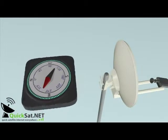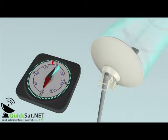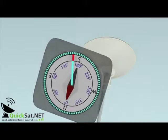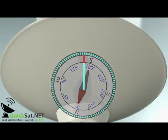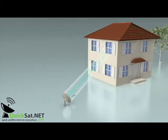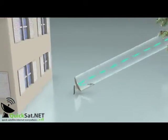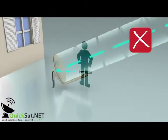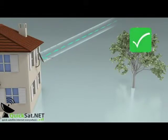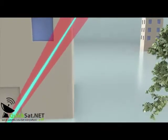Now you have all your parameters for your line of sight, you can start choosing your installation position. With your compass, identify the azimuth angle the antenna must face. You must have a clear line of sight to the satellite position with no obstacles such as buildings or trees. A person should be prevented from getting within a distance equal to the diameter of the antenna. You should also have approximately a 10-degree margin between your line of sight angle and any obstructions.